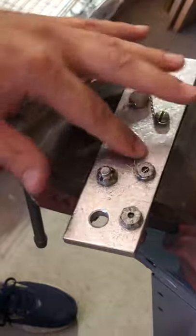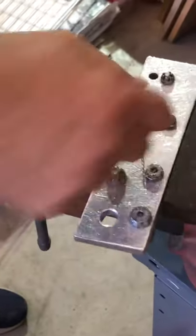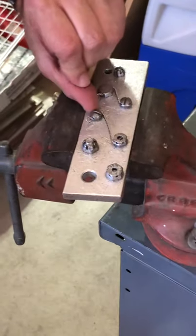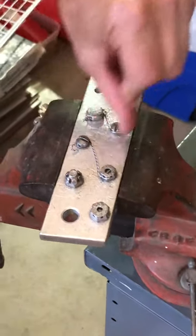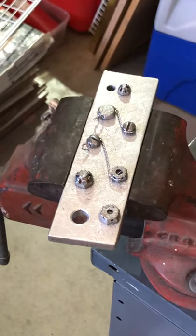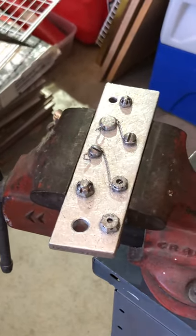And there we are. That's going positive pull. That's going positive pull. Nice and tight, nice and tight. The test is: if you can grab it here and pull it over the top of the head, it's too loose. Can't do it. Can't do it. So I'm going to call that airworthy — and there we are. Have a safety wire.